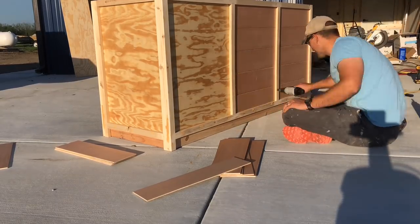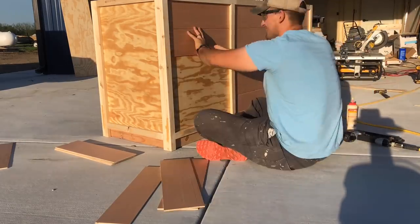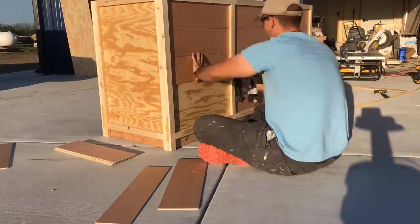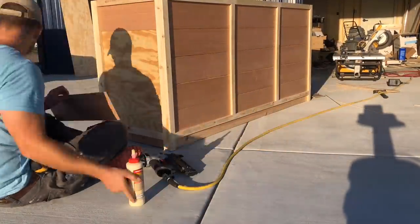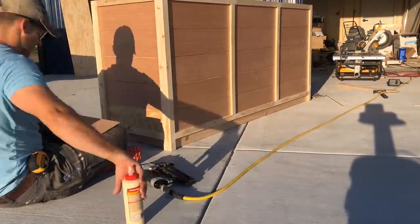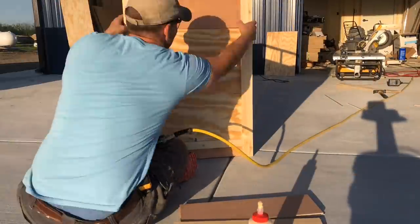Because of that gap you may need to make your bottom piece a little bit more narrow than six inches — my bottom pieces all ended up being about four and a half inches. I'm doing this to give the island a shiplap look, which is way cheaper than real shiplap. I'm sure this shiplap method would work on all kinds of different projects.